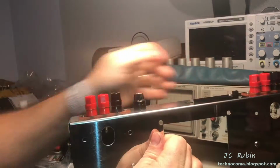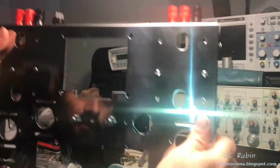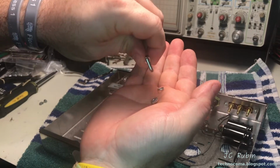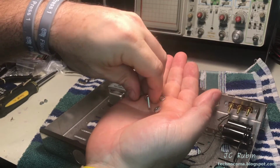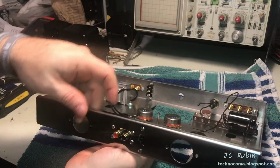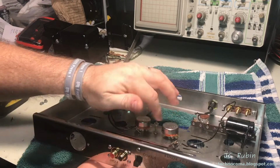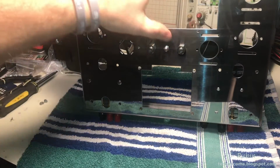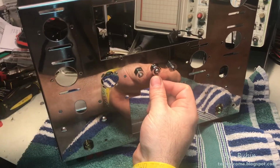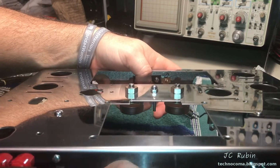Okay, that's installed. And while they cannot be seen, the screws are lined up, just like these, because I know that they're there. The first portion of this rectifier will just be this screw that was fabricated, a lock washer and a nut, and this will leave a stud sticking out through the chassis. I'm going to have to tighten down this stud so that the acorn nut is parallel, just like these two nuts right here. Everything's lined up real nice.